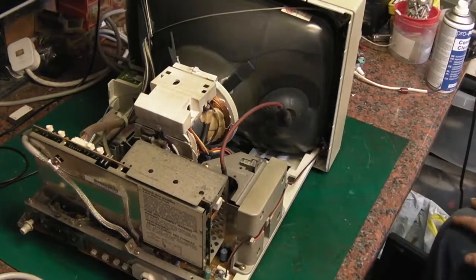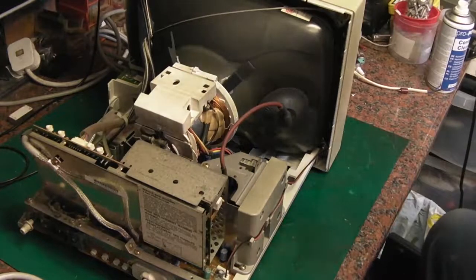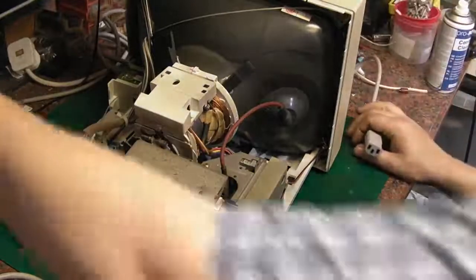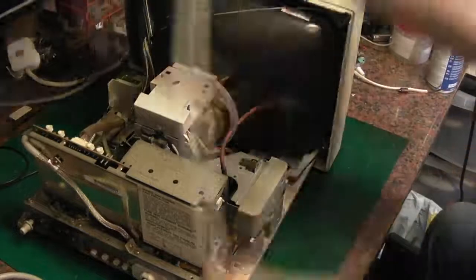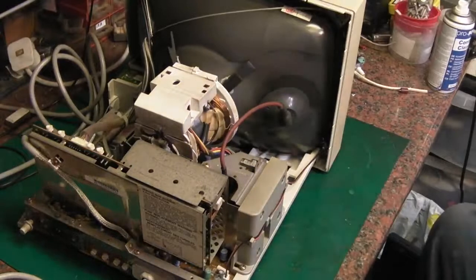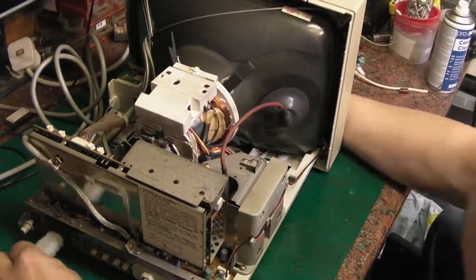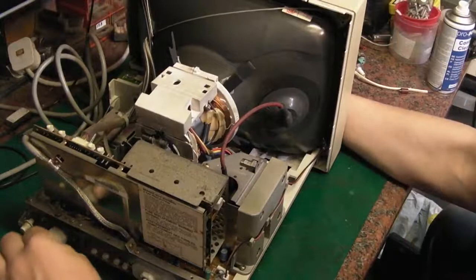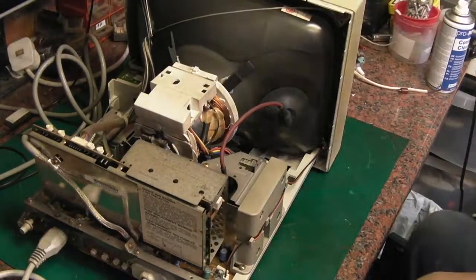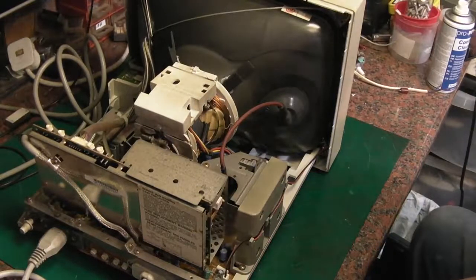Anyway, I think the first thing we need to do is get that CRT discharged, so we can disconnect the high voltage side there and we can slide the chassis out and actually work on it safely. So what we're going to do, first of all, we'll switch that socket off that I've got on the wall. I've got an IEC lead plugged into it, but it's switched off. And we're going to plug this into the back of the monitor. That's going to provide a good ground for us, because what we need to do this is a good ground. We also need a good sturdy screwdriver,